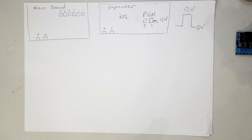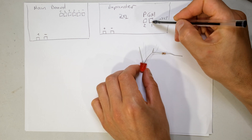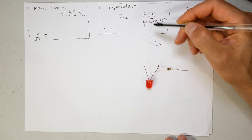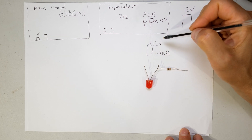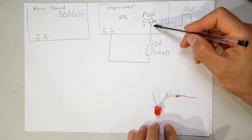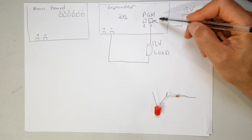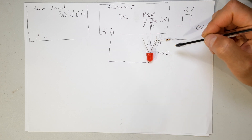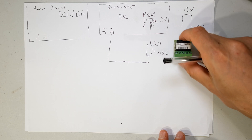In this case you want to switch on a light, for example LED lights. When you arm your alarm you have 12 volts sitting there, so you can put your load and then connect that to 0 volts. However, these programmable outputs are not able to give you a lot of current, so my advice is that you should not connect your lights directly to the programmable output. When I say load, I actually mean relay board - that is the purpose of the relay board.